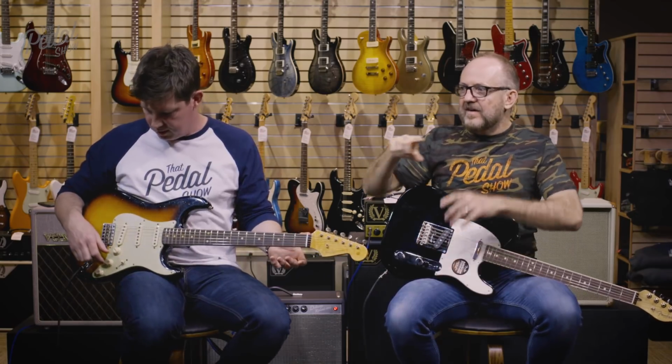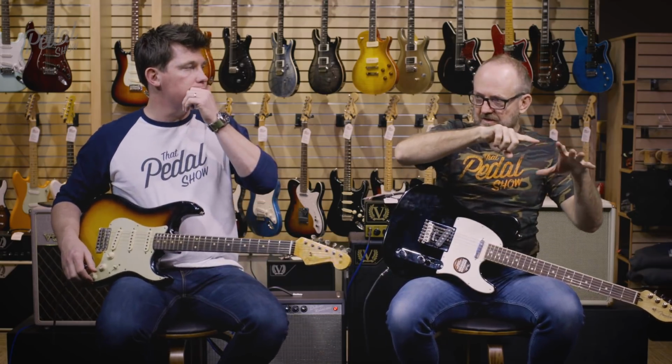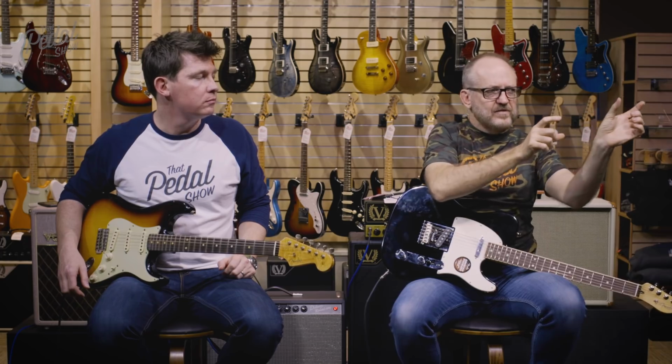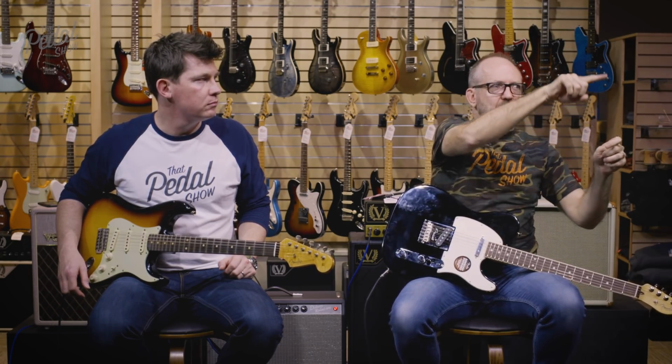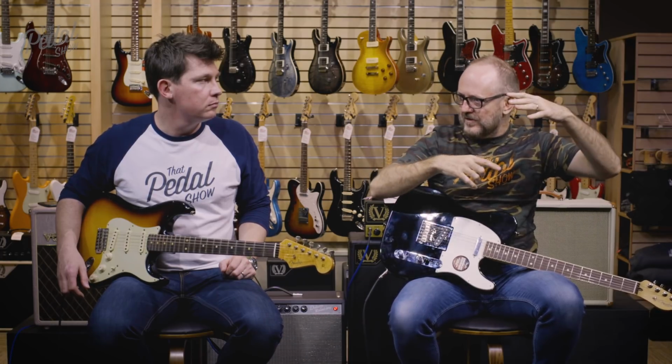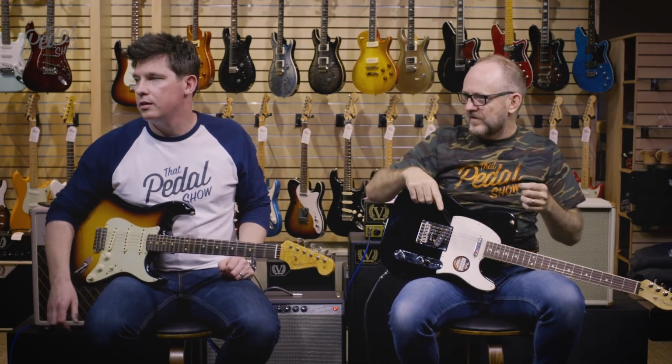That's just the guitar. So if you can imagine the fuzz, the signal's coming in, this square wave, as we add some resistance to the beginning of that, instead of it square waving, it's now just softening off the edges. The signal is the same amplitude, but we're just not distorting it as much. It's just not clipping those frequencies as much.